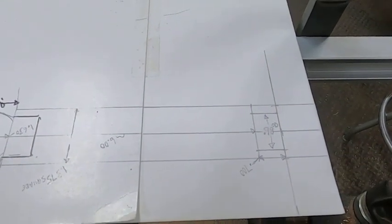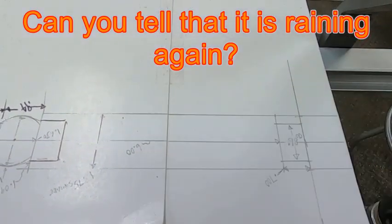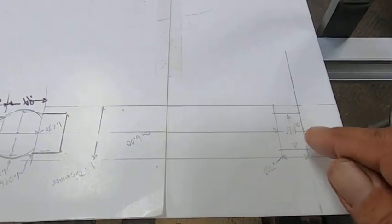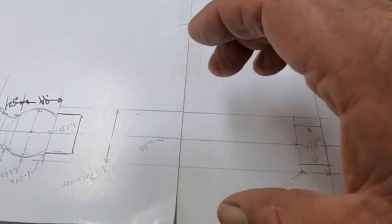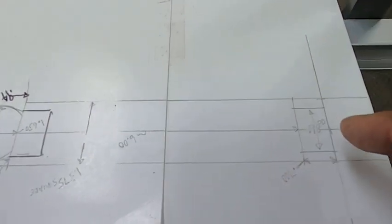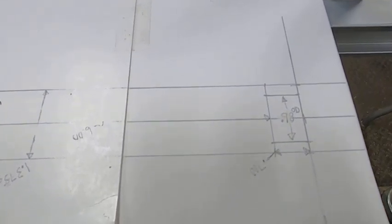So what I'll do is I'll make the hole a little bit loose by making the tenon a little bit small, put glue on it, and slide it up in. When the bottom of the baluster gets in place, it should just pop right down and fall into the hole that's already drilled in the staircase. I can't change the way that is.